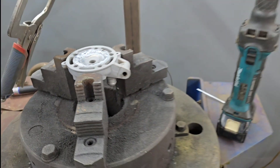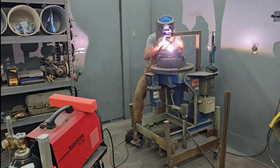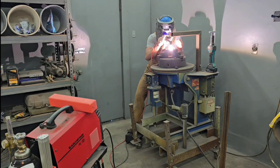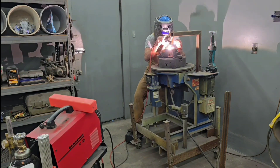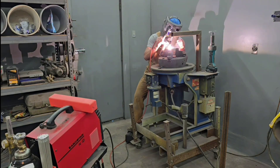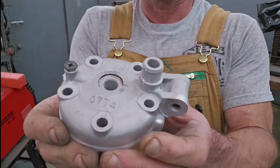This makes it so that when I'm welding there where the pitting's at on the flat part of the head, I'm not going to be worrying about weld falling over the cliff. What I'm actually doing on this second pass is focusing on just running from that weld bead I just made out to the outside as far as I can go. I'm not worried about putting too much on it — I'm just worried about making sure my weld is good and solid. He can machine it down and make it perfect as long as I've got good solid material there.